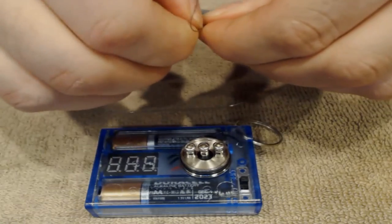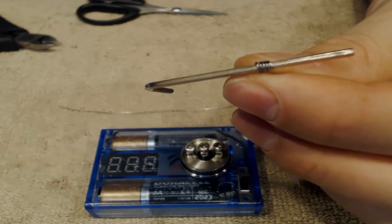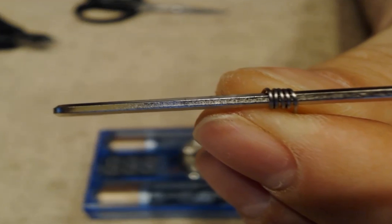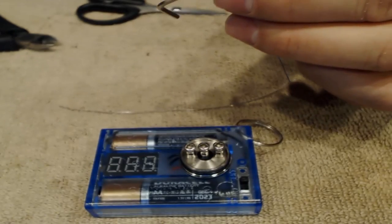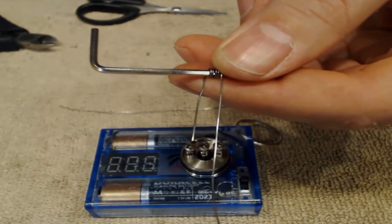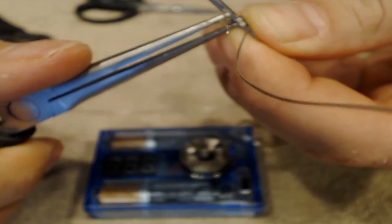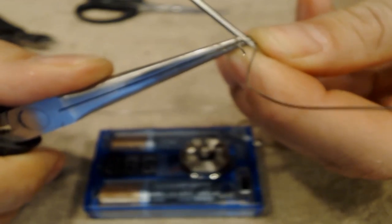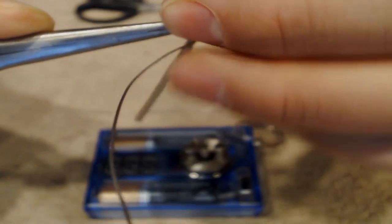Let's straighten these out a little bit, make sure they're all nice and neat so that the coil looks good. We'll tighten it up once we get it on the atomizer. Now here's the biggest step — I take a pair of needle nose pliers or something similar that I can grab onto, and I take the leg on the bottom and bend it straight like that.